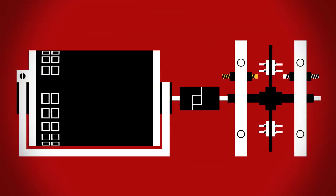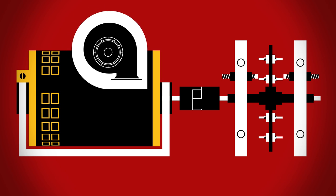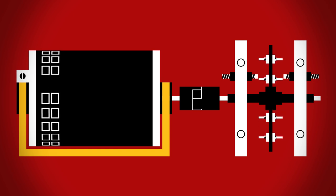So, for those of you that don't know what a synchronous rotary spark gap does, all this stuff is happening here to make a very accurate switch. That's it. This just turns things on and off. This turns high voltage, high current electricity on and off very precisely. We have a modified electric motor. Originally, this is just a regular little electric fan motor, for like a squirrel cage fan or something like that. And this particular type of motor sits in this cradle type mount. That mount allows us to rotate the motor and change its position, and then lock it down.